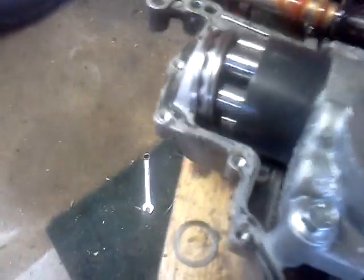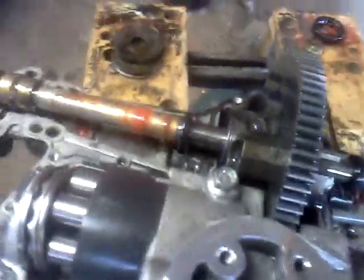That's how a hydrostatic pump works on any lawnmower — it's pretty much the same design. I kind of found this neat though: if you spin this one this way, this one will turn the opposite way until it's under load. A lot of lawnmowers have it.